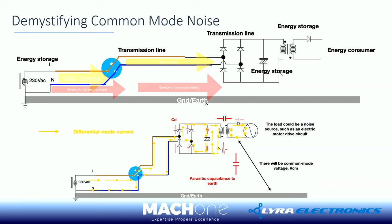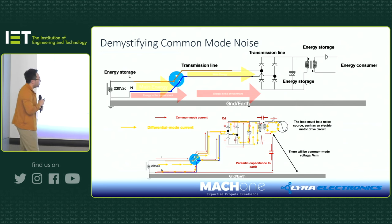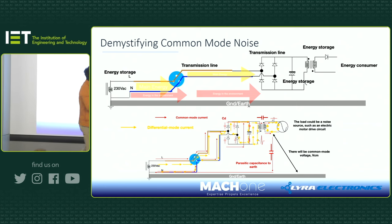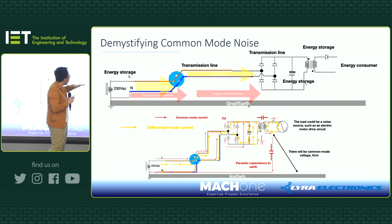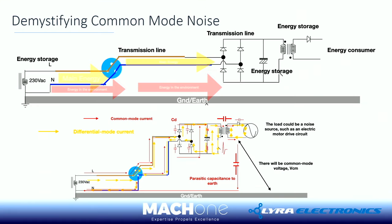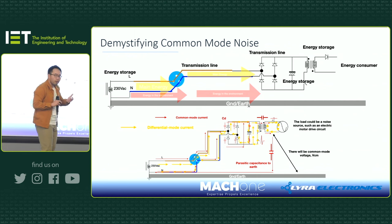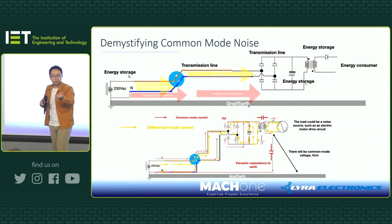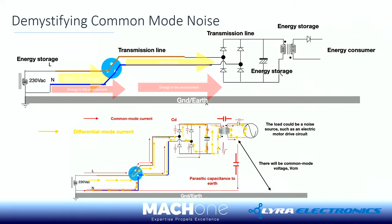Everything is easy. Now, we also said there will be surrounding structures providing you energy. And these basically go through this way. All the energy near this circuit is stored in the space. And in the space between the unit and the earth, there will be parasitic capacitance. And we know parasitic capacitance stores energy. Tiny, tiny energy. Generally speaking, you have 50, 100 picofarad capacitance between the circuit and the ground. But still, that's a 100 picofarad capacitor. Do the math, one half C V squared. You can calculate the energy stored in that parasitic capacitance.